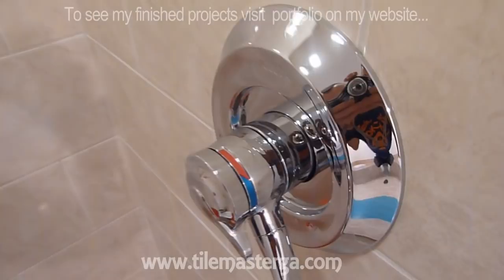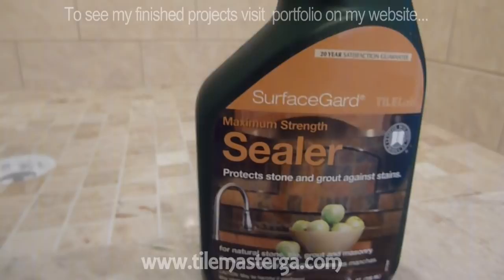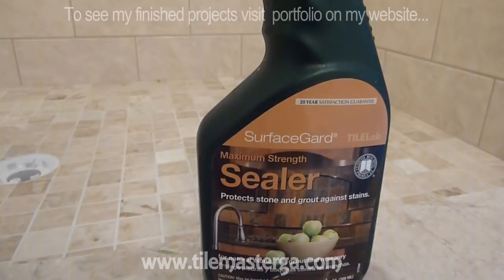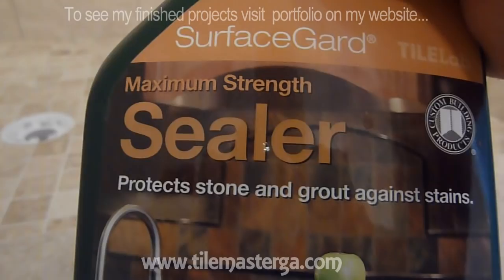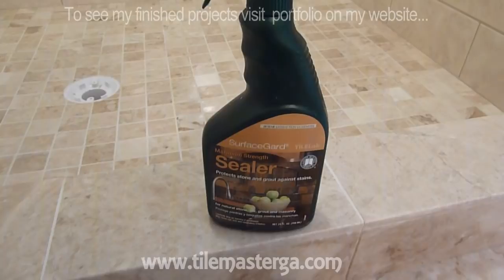Okay, one of the very last parts of our project will be sealer application. We already used a product that makes grout stronger and more durable, but sealer is always a good option on top of any other product. So what I will be doing is spraying this sealer on top of the grout and tiles. It's a must for the grout, and if we're dealing with stone tiles, it's also recommended. So keep that in mind.